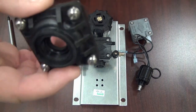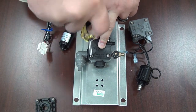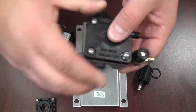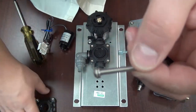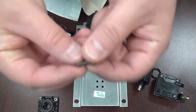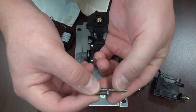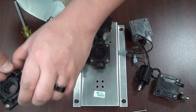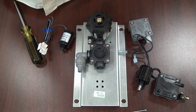In order to change this over to a 9 volt solenoid, you'll need this bonnet and these short screws. First, remove these four screws. Once loosened, take this off. I'm going to show you the difference between the screws — this is the screw out of the metering servo motor and this is the screw out of the solenoid bonnet. One is half the size of the other because the distance from where the bonnet screws into the valve body is much shorter than the metering servo motor.